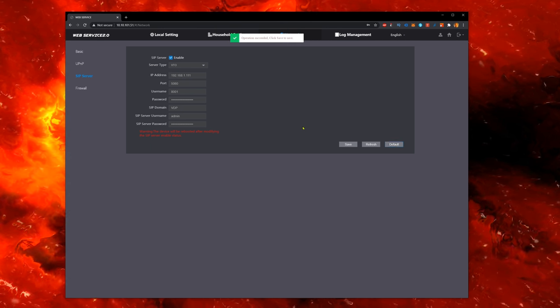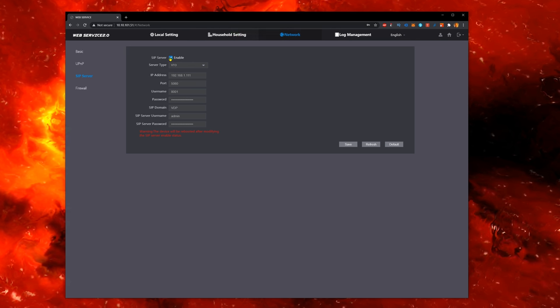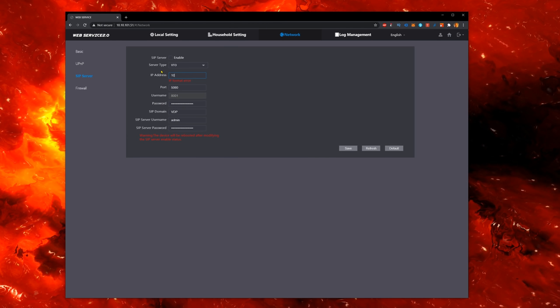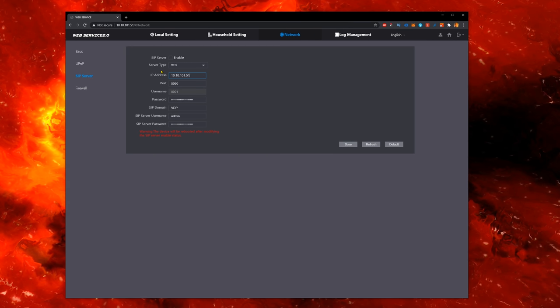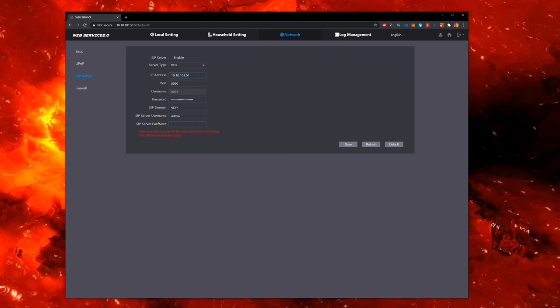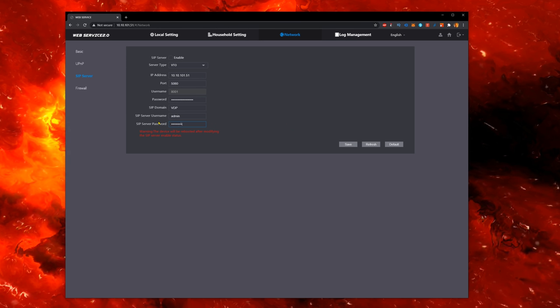All the devices talk to each other using the SIP protocol. By default, the outside unit runs this server. That is fine for our current setup, but we do want to change the SIP server user and SIP server password. Make sure to keep the first user and password listed default. I'm not entirely sure what those do, but if you change them, I ran into trouble.